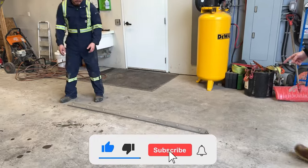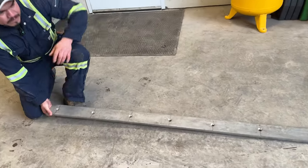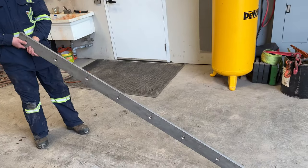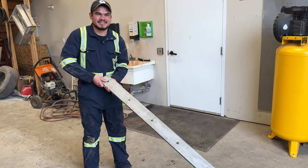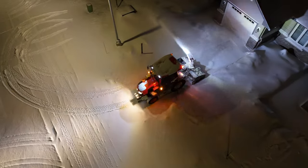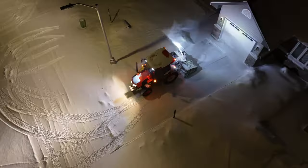You could see on the ground, Eric custom fabricated the stainless steel cutting edge in-house here at Northern, and you guys could see this is a hell of a cutting edge, some thick material, and really does the job well for us here at Northern. Italian steel. Italian milled steel, our favorite. 5/8 thick, just a mean cutting edge with plenty of integrity. That's what we run on our blowers across our entire fleet.